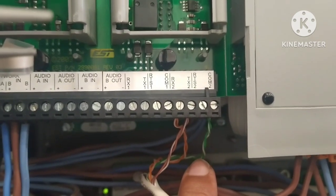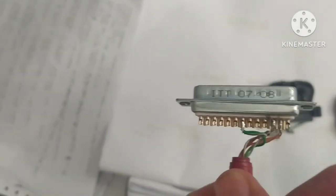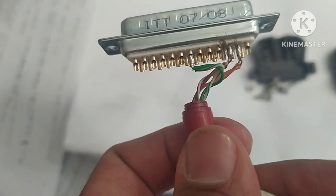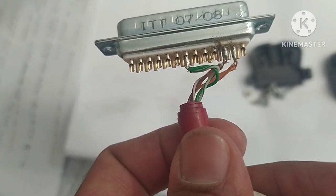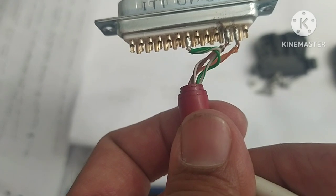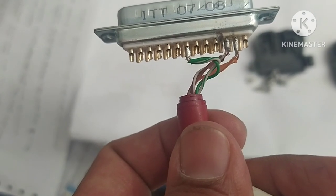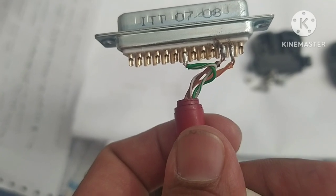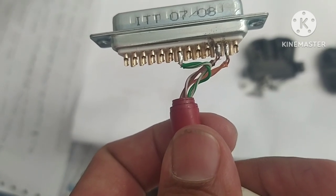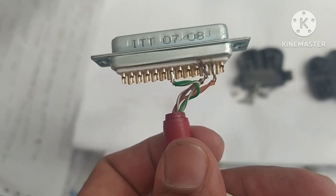You can check the printer connector — this is the printer cable. Count the solder welds from right to left: one, two, three, four, five, six, seven, eight. Number 1 and 2 — orange cable soldering. Number 3 — gray cable. Number 7 — green cable. So you connect pins 2, 3, and 7 to print out from the fire alarm system.